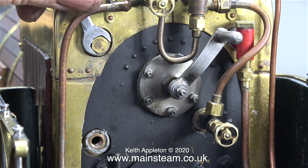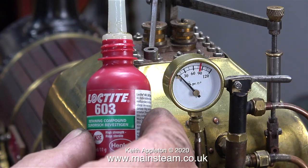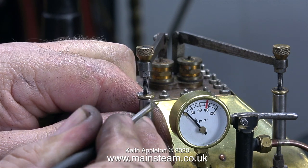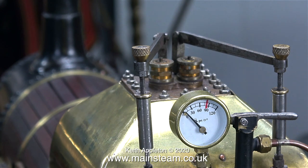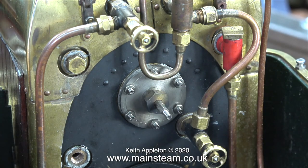The four-and-a-half inch scale traction engine I have has been a very big and long job; in contrast, this is not a long job. I'll shorten the threaded shaft to the dummy safety valve, then put it all back together and use some Loctite 603 to hold the brass fitting in the top of the tube. Call it OCD, call it what you like, but it really annoyed me that one of the shafts was sticking up and the other wasn't — now after a minuscule amount of work it looks a lot better. I also removed the regulator handle and cleaned that up because it was a bit rough. I really do not like hammer-and-file engineering; I like things to be finished properly. I'll stop talking for a while and give the engine another run.